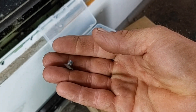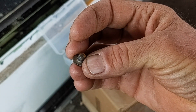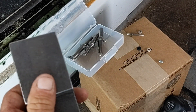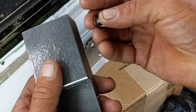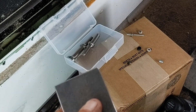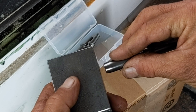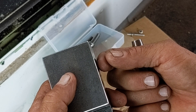With buck rivets or solid rivets you can't do that — they're really too hard to cut through easily with a chisel. The way these are installed you need access to both sides of the panel. They're called buck rivets because you use a bucking bar like in auto body work. The rivet goes through the hole, the back goes up against the bucking bar, and then you have an air hammer with a bit that has a dimple head that goes over the rivet head and you hammer it flat, clamping the pieces of material together.